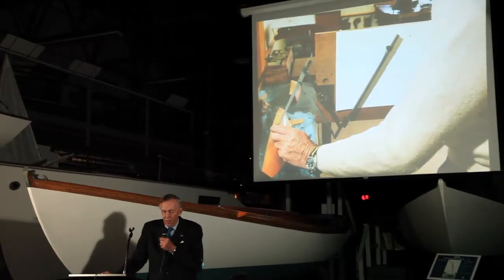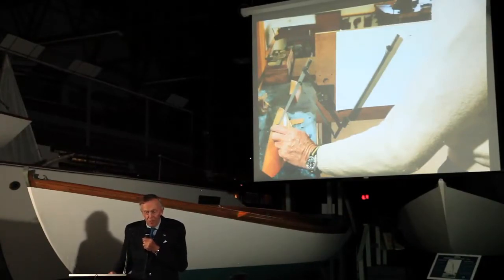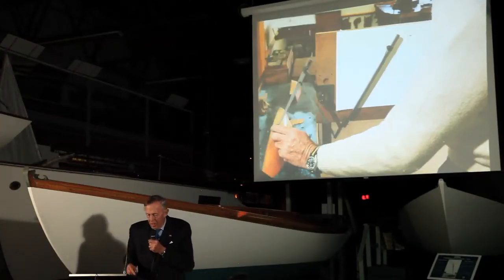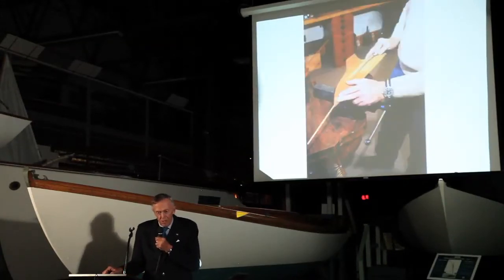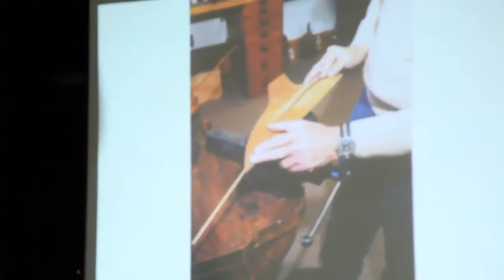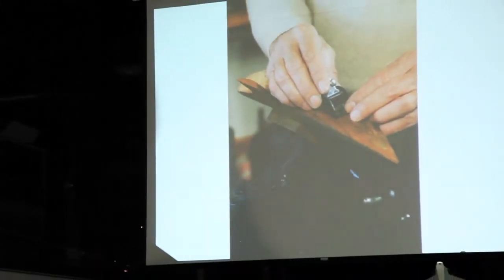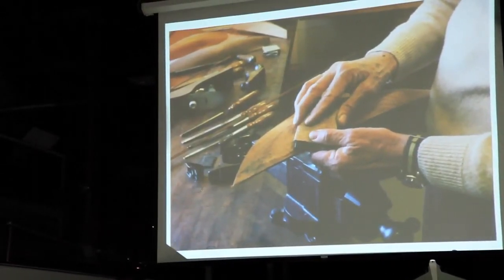That's all done at model scale, but whatever you do at model scale can be enlarged to full scale. He would then go back to the modeling and maybe repeat this process a couple of times, particularly for a very important boat like an America's Cup defender. When working on the model, always use the batten in the latter stages — don't do any cutting unless the batten is employed to show the high spots. And that's one of those little five-cent planes being used to complete the forward end of a small model.